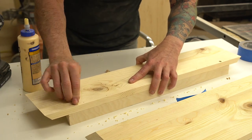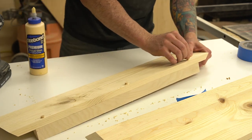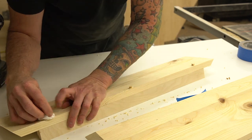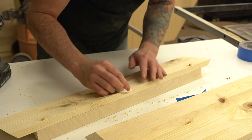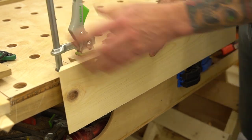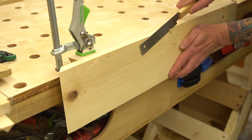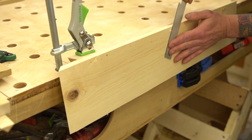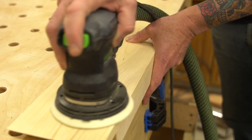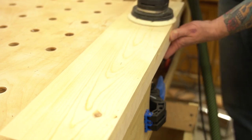Then I took a 3/8-inch dowel rod, cut down a few small pieces, filled those holes with wood glue, and set a dowel piece inside each one. A little later I'll take a flush cut trim saw and cut these flush, then sand them down. I personally don't like exposed screws on a project like this. These flush trim saws come in a variety of makes, models, and price points — I picked up a cheap one from Harbor Freight. It works well for the price, just be aware the blades dull fast. Since this is a rustic distressed piece I wasn't concerned, but if you want a clean look, apply painter's tape around the dowel to prevent the saw from digging in.